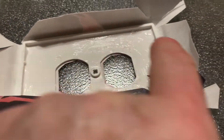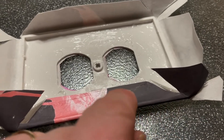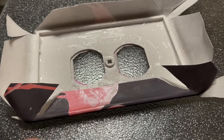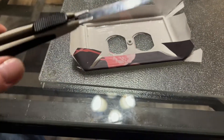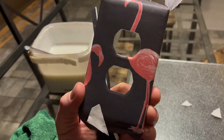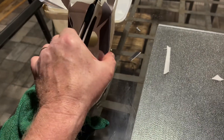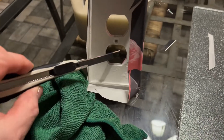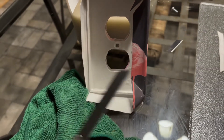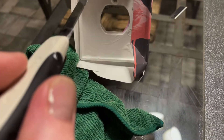This side also has to get scratched up, because the flap — unless you're going to be taping it — goes over onto the other side and glues to it just like the front did. What I was talking about before is: if you extend the blade out and you cut the holes out of the wallpaper, extending through the hole and cutting it on an angle, that would afford you not cutting too much of the paper off.